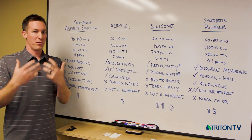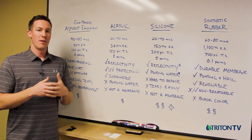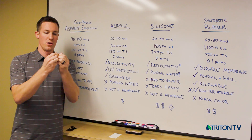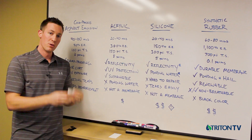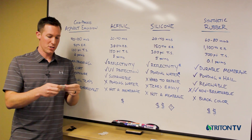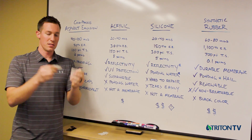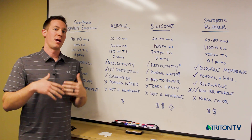Acrylic is used as a UV protection coating and is highly sustainable because it can be easily repaired and renewed over time. Its properties are like a high-grade paint — some roofing acrylics have decent tensile strength, but they tear easily and have limited elongation at break. When fully adhered to a surface, movement goes from absolutely no distance to a significant distance during expansion and contraction. It's inexpensive and a great way to extend roof life when a new waterproofing layer isn't needed.